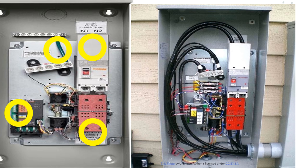In the center between the two units is your main breaker. When utility power drops out, the transfer switch senses it, tells the generator to start, and within about 10 seconds it automatically transfers over — blocking out the utility side and energizing the generator lugs below the red piece. When it senses power is back, it automatically transfers back over, re-energizing the utility conductors to the customer's load side, and after a cooldown cycle it shuts off the generator. On the pre-wired unit you can see this all play out: utility conductors on top, load going to the customer's house on the bottom, and the generator cable feeding the generator.